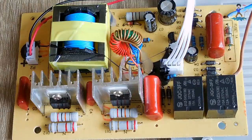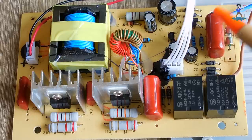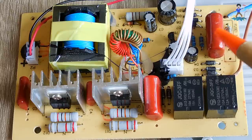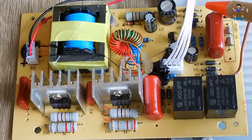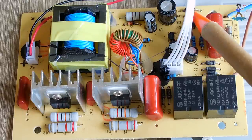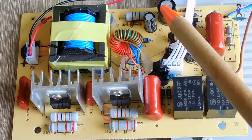The way this circuit's designed is like many others shown on my channel. It uses capacitive reactance to reduce the incoming AC current. It's a transformerless power supply. When the current flows through, it is then rectified using a full wave rectifier. You can see the four diodes. And then to smooth out the AC ripples, that's the purpose of the capacitor, the electrolytic.